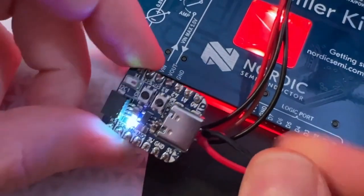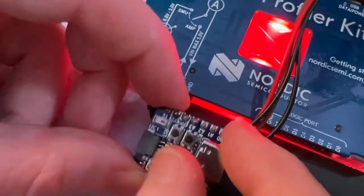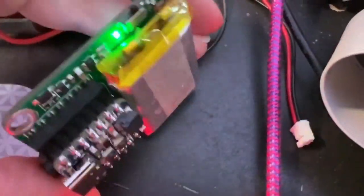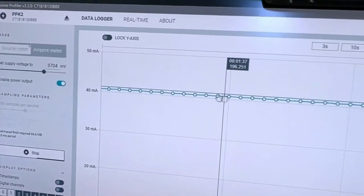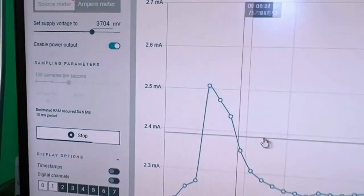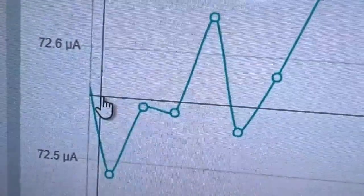Ada, what is this? I'm finishing up my last test for the CutiePie ESP32 — the Pico board that I designed and have been working on over the weekend. I'm doing some power tests. I did functional tests by having it in the CutiePie board so you can emulate NES games. But for people who want low power functionality, I want to make sure that's fixed up. Here is my PPK from Nordic. Normal functionality is about 40 milliamps. Light sleep is about 2 to 3 milliamps. And for deep sleep, when I turn off the NeoPixel, I get down to about 70 microamps, which is great because the chip is about 50 microamps and the regulator is about 20 — total about 70.